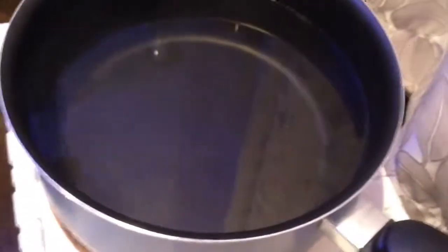Yeah, guys, I just wanted to jump in here and show you, like I promised you, some tips and tricks. It's nothing major, but it might help some people here. If you have a hard time getting the hosing onto some of these fittings, it helps to boil some hot water and dip the tube inside the hot water for about 30 seconds or so. It definitely softens up, and you can just push it on there properly, and it's a nice snug fit.